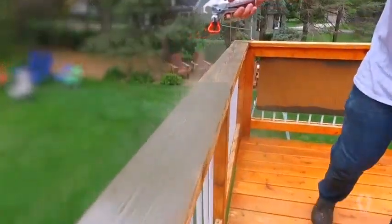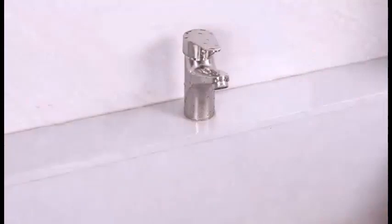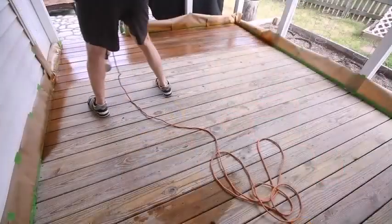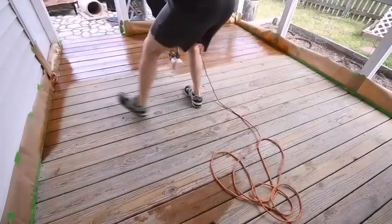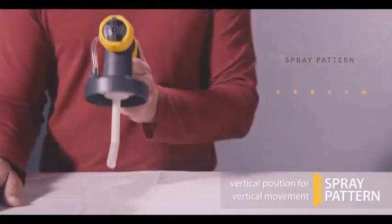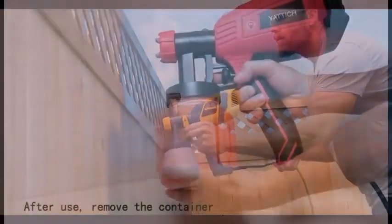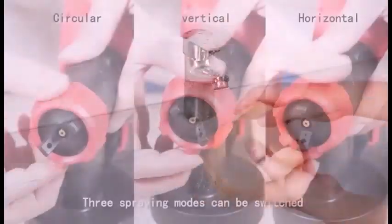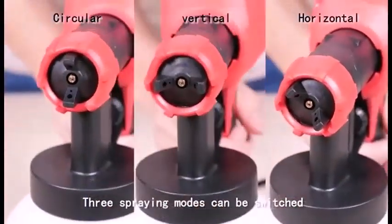And the quality of the final finish isn't as important for those surfaces. One of the advantages of airless sprayers is that they can spray high viscosity material without the need for thinning — you almost always have to thin material before spraying it with an air gun. Because the spray from an air sprayer is delicate, it needs a thin coating on the surface that usually has to build up by repeated applications, which provides the opportunity to buff between coats to produce high-quality finishes.